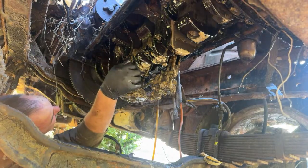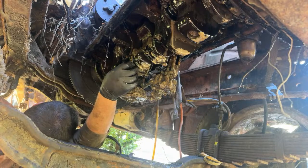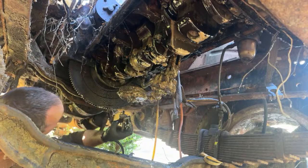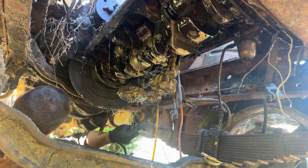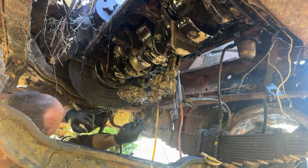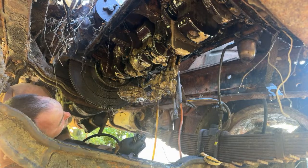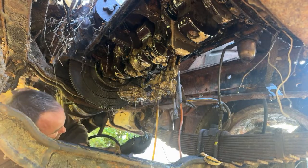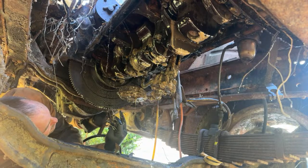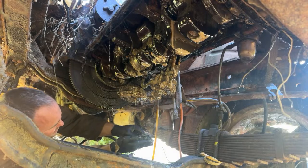Dwayne said, how about pressure on the cylinder, then wood block in another and hit with sledge? Just a thought. I had, can he hear me? Oh yeah, that's under here, isn't it? Yeah. I had the porta power from the flywheel to the chassis on the bottom here, so I had all that leverage, and then I was up the top with a wooden block, hitting every one of them, and it was hard to tell which way. You're probably fighting against the porta power hitting some of them, because it's hard to tell if it was on upstroke or downstroke. But I hit them all anyway, just trying to shock them all. But there wasn't a bit of movement.